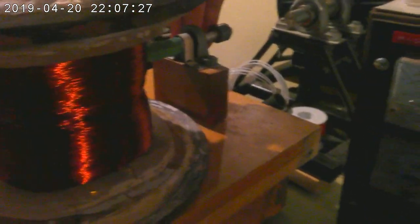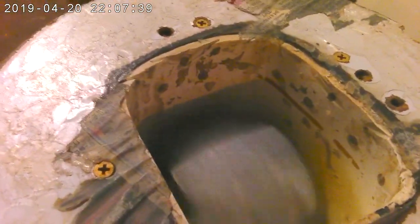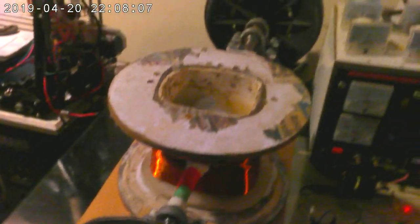However, what I'm going to do is the same again, up to 300 volts. And I should explain, this is way, way faster than this thing used to run, due to that excess wire, and it's still very efficient. It's currently running 550 RPM, and I might turn it up a little more, but I'm a little concerned if I go any higher than that, because my whole desk has a very vivid resonant oscillation being transferred through it.